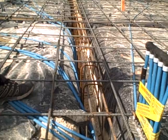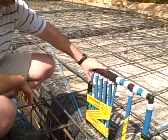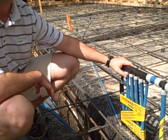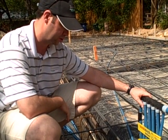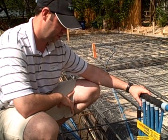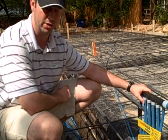This is all ready for concrete on Monday so it's totally prepped. One of the things I wanted to show you while we were over here is the termi-mesh system. This is a termite proofing we do that's a physical barrier to termites rather than dumping chemicals into the soil like you see done in a lot of parts of the country — and what I did ten years ago unfortunately. This is a physical barrier to termite intrusion into your house.